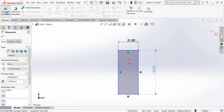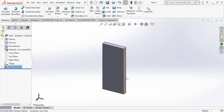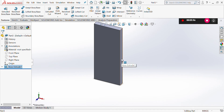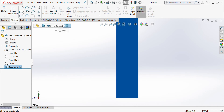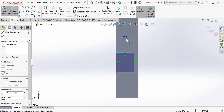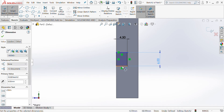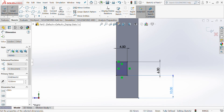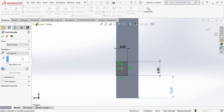So again Features > Extrude, change that to 9, enter and tick. I've now got the other side — I just need to put my housing joint in. Just like before, choose this edge, space bar, zoom into the bottom, Sketch, Rectangle. Same dimensions as before: 4.5, enter; 6, enter; and 10mm between those two lines, enter. Then go to Features > Extrude Cut, change to Through All and tick.